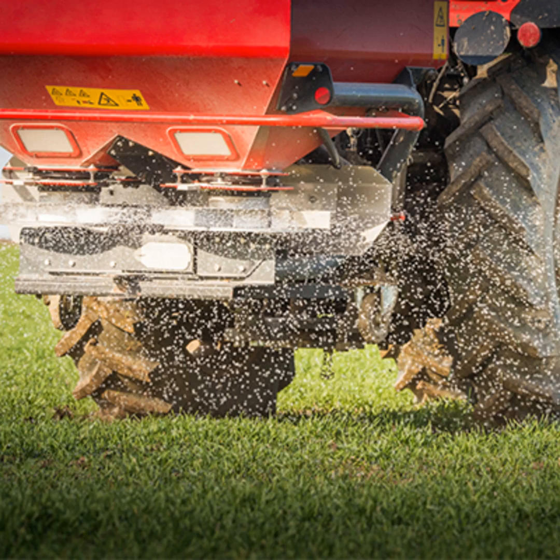With urea especially, people often don't think about wind. Going out on a windy day will have a huge effect on your spread pattern. The top of the range fertilizer spreaders now come with a wind gauge and will automatically adjust the spread pattern to throw harder into the wind, and once the wind exceeds a certain speed, it stops spreading. That can even happen within a farm on a given day — going out to a more exposed field can make a big difference, so it's important to factor that in.